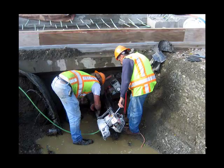There was no simple solution to this problem, and it was determined that the conduits would be hung from the underside of the bridge. In this photo you can see holes are being core drilled through the back wall of the abutment, and eventually the conduits will be run in the space under the bridge. That's a significant change.